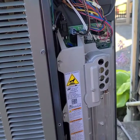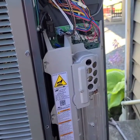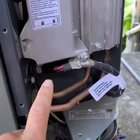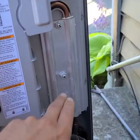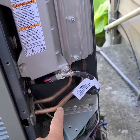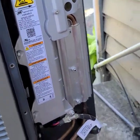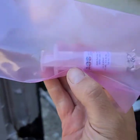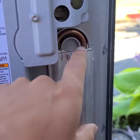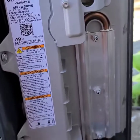I got the code, got the drive ordered up, took about four or five days, and got back out here. It was actually pretty simple and straightforward. I killed power first, disconnected all the wires and the main power plug down here, then there are these three little bolts right here — I took all those off and it opens up this plate that actually senses refrigerant temperatures, so the piping goes up through it. They give you what I think they call thermal paste in this tube right here.